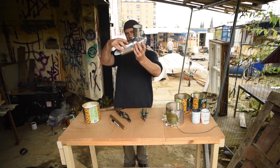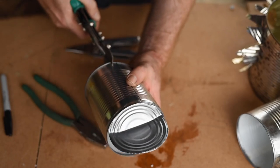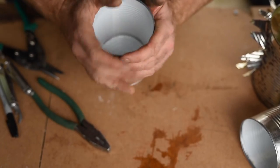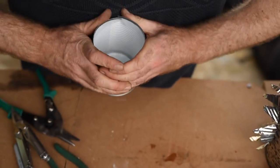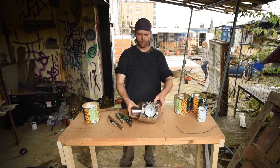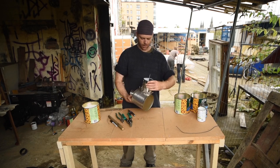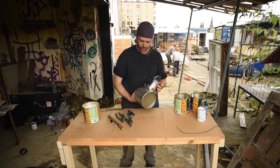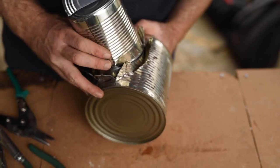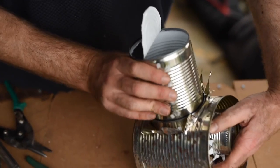To connect this into the assembly in a strong way: on the bottom side, make a little cut of about one centimeter — not very deep — and then crush that in with some force. Then compile all of these together: take your inner bit and chuck it so it's poking out through the hole. Then take this piece and very carefully force that into there, because if you slip you're going to touch the metal. This can take a little bit of force. Then twist the front can so that your shelf is horizontal.